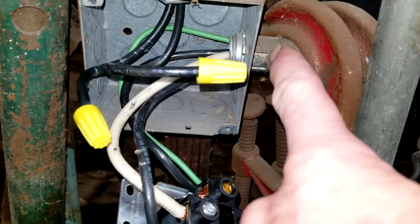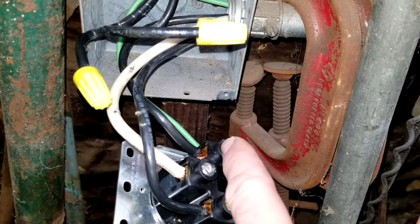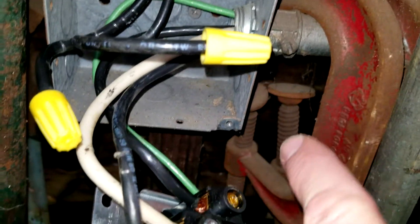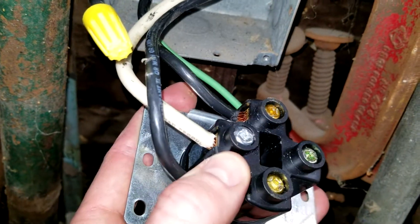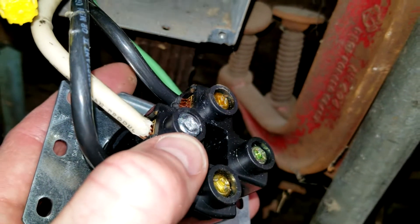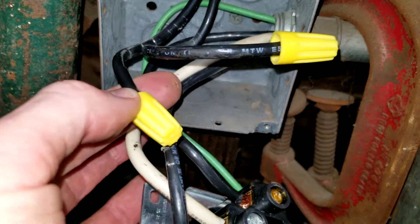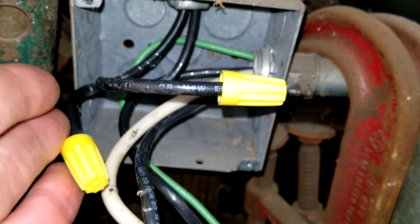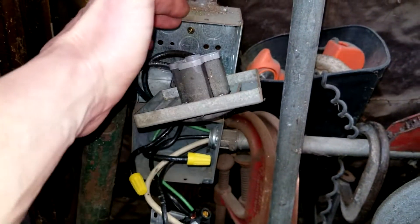So again, one of the black wires coming out of the conduit from the breaker box is going to go into either side — doesn't matter which one. We only have one black wire going in here; the second black wire coming out of the conduit is going to go into the other side. Our neutral white is going to go in the silver screw. The ground is already nice and latched up tight. Double check those bolts — make sure they're nice and tight so those wires don't come loose. I've capped the ends of the wires going up to the old receptacle to prevent shorting or any electrocution.